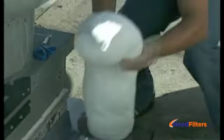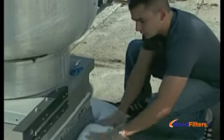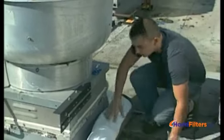There will probably be some overlap in the boom, so you'll need to cut it. Make the cut so the two ends butt up together tightly. To make a clean cut, simply pinch the boom and push back the filling on either end of the pinch point. Then, secure a zip tie on both sides of the pinch point so you can make a clean cut in the middle without the absorbent media spilling out.